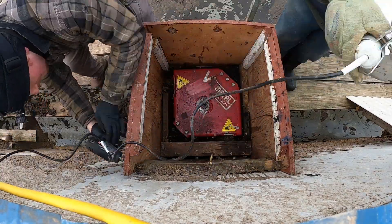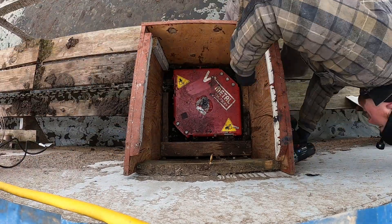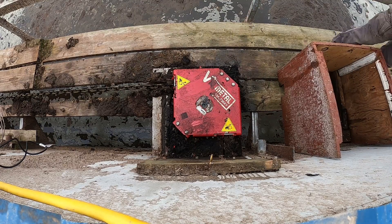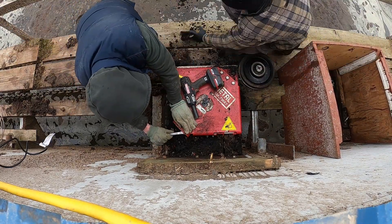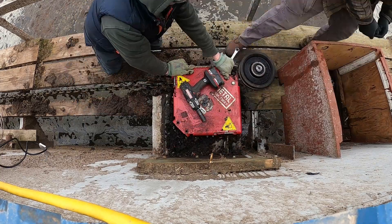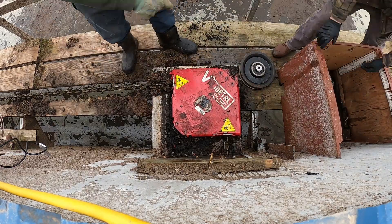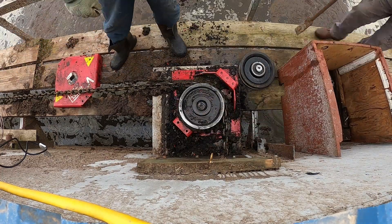So now we're out standing above the pit on the catwalk. First things first, we're going to remove the heat lamp — that's what keeps it from freezing up during the winter — and we're going to remove this weather box so that we can get at the corner wheel. The corner wheel has five bolts holding the lid on, so we're going to go ahead and zip them off. You can see I brought the newly rebuilt wheel with me so that once we get it off, we can just swap them out quick and keep things running. We have an extra wheel now, so as we swap them out, we can rebuild the next wheel — we'll always have a spare wheel.